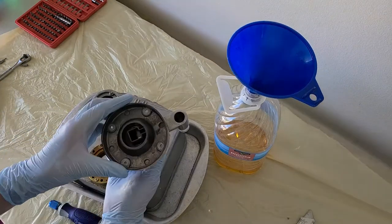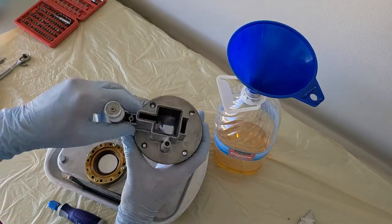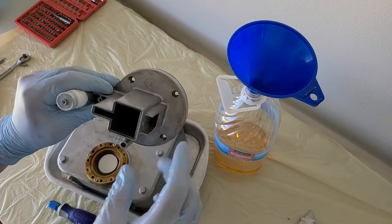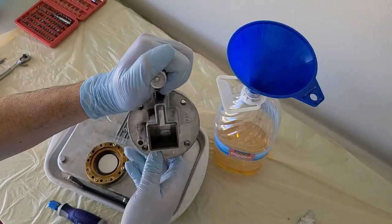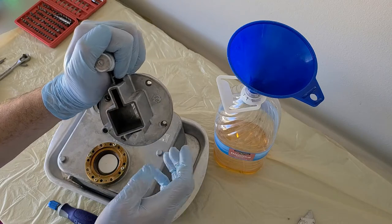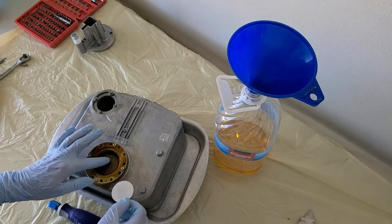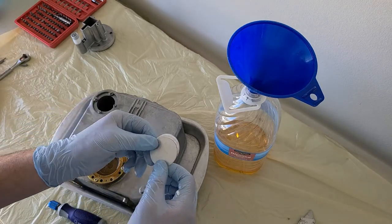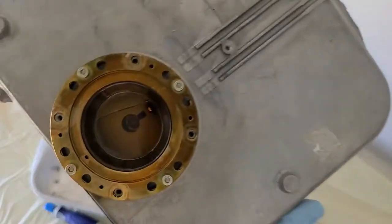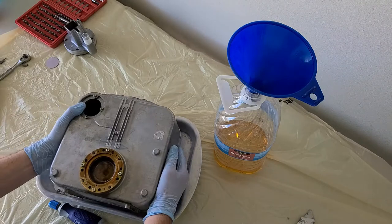I got this little piece off — it's like the collimator. Basically it's just there to narrow down the beam, make sure it's lead lined inside so no x-rays escape. It also has this little channel you can see right here to make like a thin slice of x-rays. And here's some aluminum filtration. The tube is right underneath this plastic cover, which I'm going to go ahead and take off now.